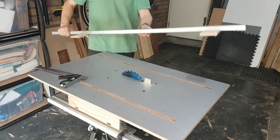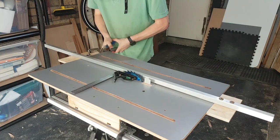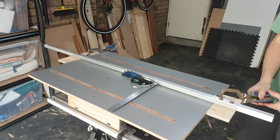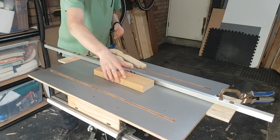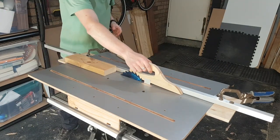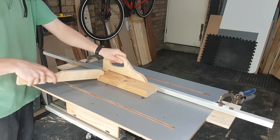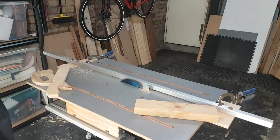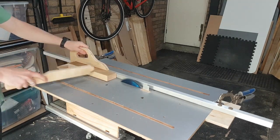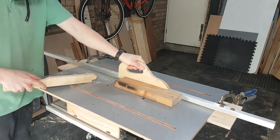There are all my pieces crosscut and now we're installing the rip fence so that I can begin the process of cheating these joints. The way I'm going to do it is by getting the blocks and instead of trying to cut a 45-degree mortise, I'm going to trim off the edges, which will allow me access to the center of the piece of wood. I can cut that on a 45-degree angle later on and then re-glue and screw it back together. The rip fence is actually relatively accurate and the new push sticks are working well too.